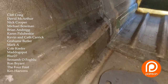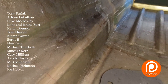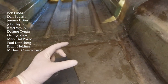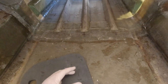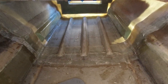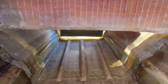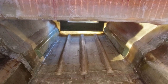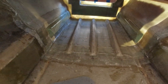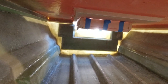However, right across this area here, this is actually going to be my rudder pedestal, and it will be a foam core sheet all the way across here where the stem of the rudder shaft goes through, and I will have it go all the way potentially to the top of this second step, and that'll give me the access for manual tiller control. However, there will be an arm around about here that can operate with some hydraulic pistons to drive my steering. I have opted for hydraulic steering, but yeah, I've got a lot of work to do in here.